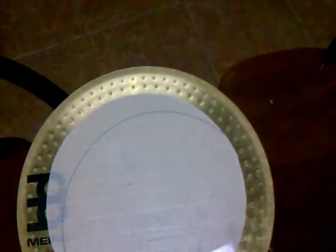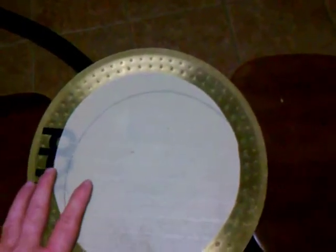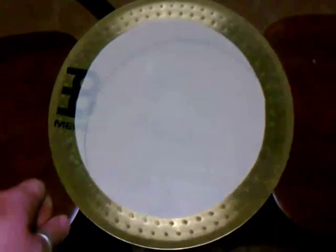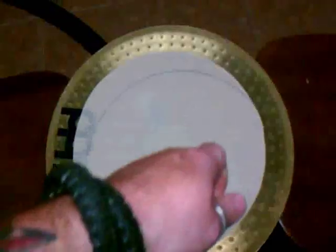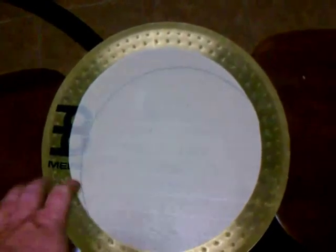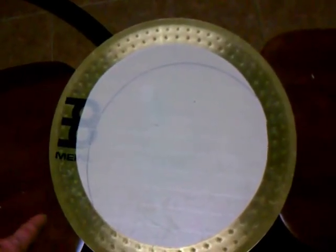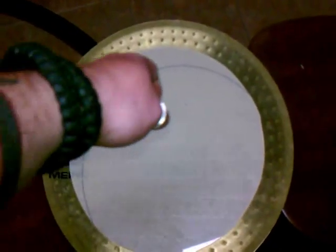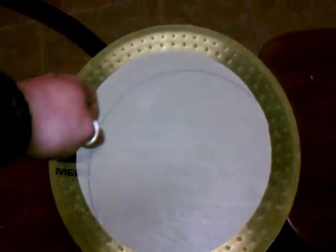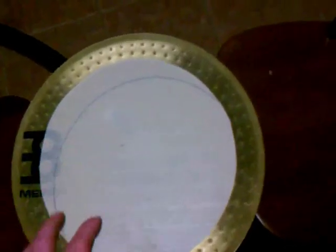And we're going to start with the vacuum off, heating the acrylic all over until you see it start to sag. Once it starts to sag in the middle, then it's time to really get started. You cut on your vacuum and start heating around the outside edge really nice and slow until the acrylic starts to form and gets a good seal. You'll hear the pitch of the vacuum cleaner change just a little bit. At that point, we're going to start working our way in a spiral pattern, real nice and easy, around the cymbal towards the inside.